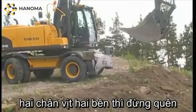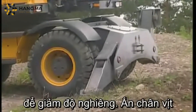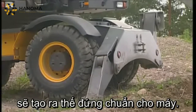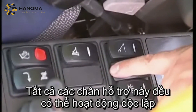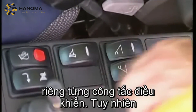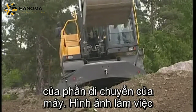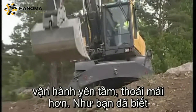If your excavator is equipped with outriggers, do not forget to use them when digging across the slope angle. Press the downhill outrigger downwards to its maximum and this will correct the excavator. All supports are individually maneuverable by simply pressing the dedicated switch, however this feature is not found on all excavators. By using it you will increase the lifespan of the transmission, increase the performance, and at the same time have better operator comfort.